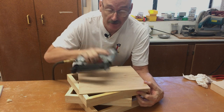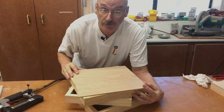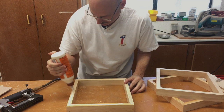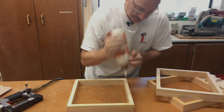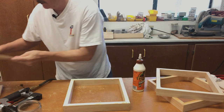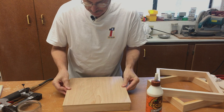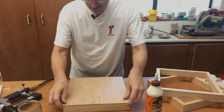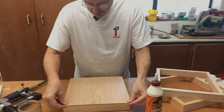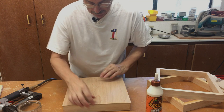For this part I've switched my nail gun to a brad nailer, which shoots a very fine, almost wire brad. It's not really necessary for strength, but it'll hold my panel in place while the glue is setting up. What I like to do is put the panel on about right and squish it around a little bit to spread the glue, then just feel with my fingers to see that I've got a little overlap everywhere. Because my pine frame is perfectly 12 inches square, I cut my panels a little wider than that so I've got a little lip there, which is good.